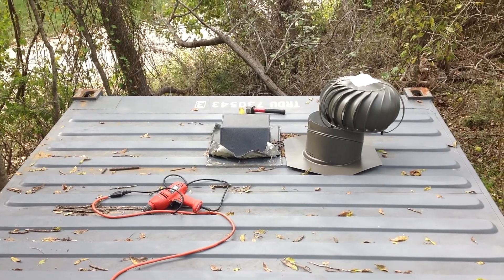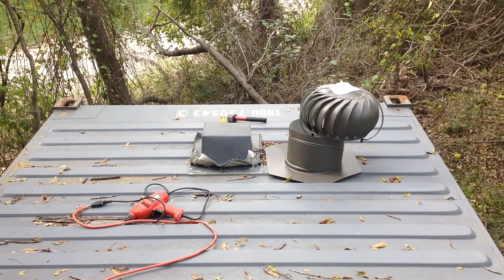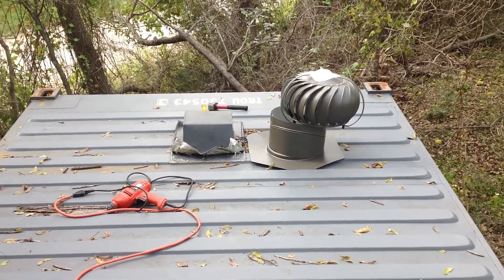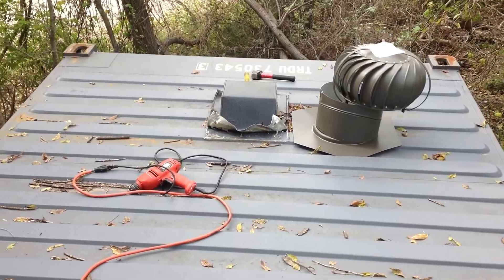Fall comes and I'm starting to have some more of that problem. So apparently there's still not enough airflow. I'm going to do what I said I was going to do — I'm replacing that passive air vent with an active whirlybird air vent with about a four inch bigger around hole.